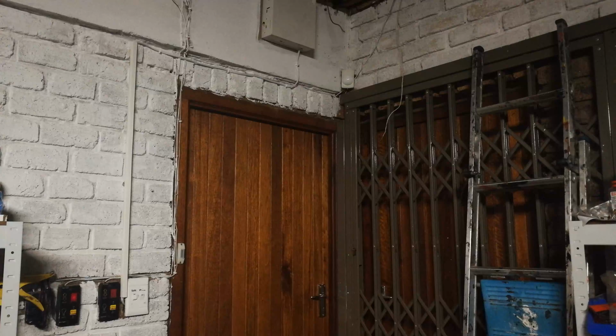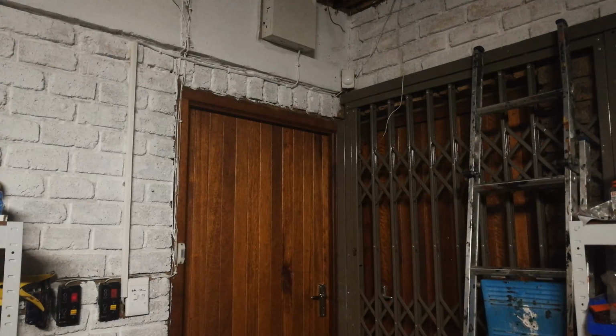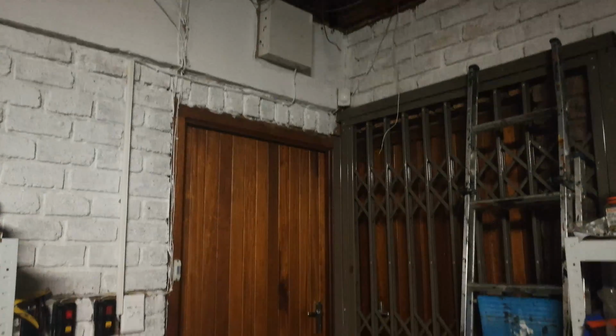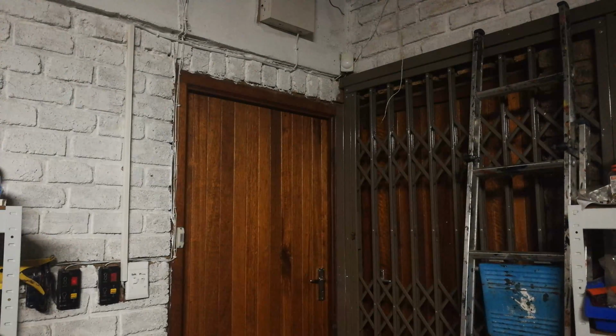Right, now you see an indoor PIR in the corner there, and this happens to be in a garage. A common false alarm in garages is, number one, the garages often get hot. So the PIR does not necessarily operate in the same way as it would indoors in a house where there's correct roofing, whereas in a garage you can see here the roofing, there's no insulation, so it gets pretty hot in the garage. The next challenge to that sensor is that in garages there's often rats and vermin that crawl around, and they can set off that sensor.